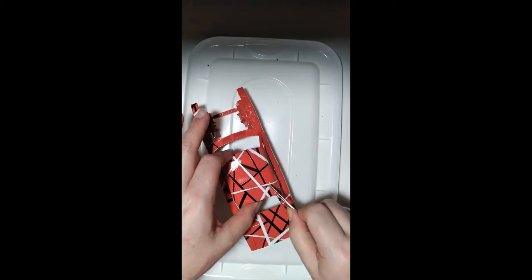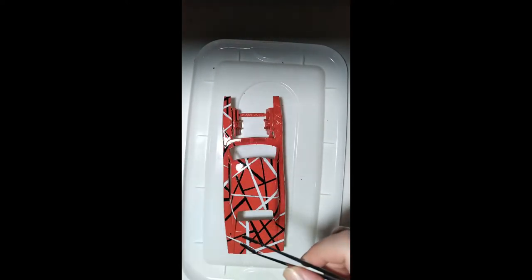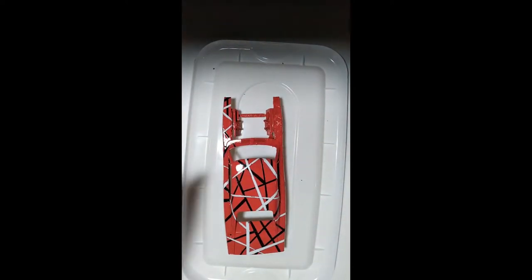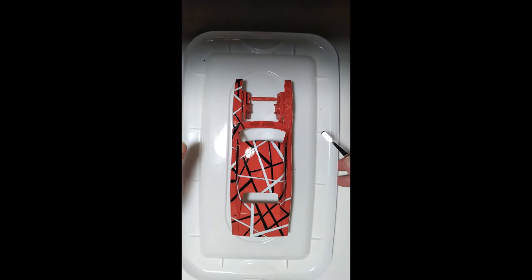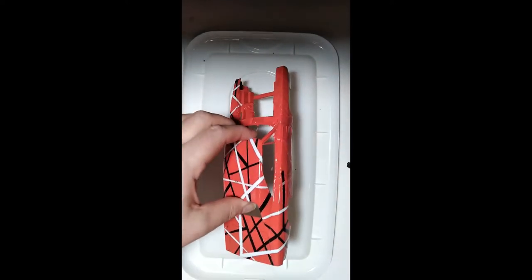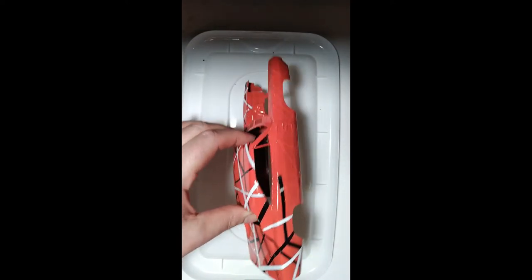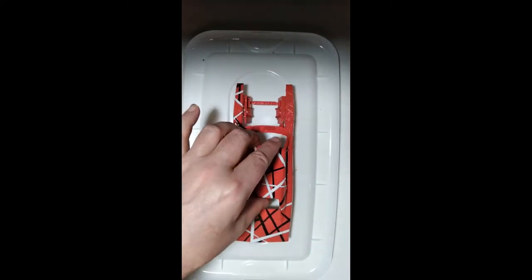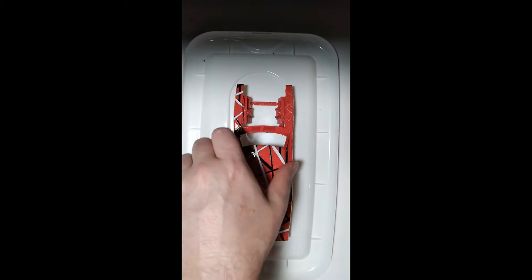When you're pulling off the masking tape, I would not only go slow, but when you're peeling, try to pull it back at an angle to where it's almost rolling back on itself, so to speak. I found that if you pull it back in that kind of rollback angle, it actually pulls off the lines. The tape pulls off crisper. You get more crisp lines.